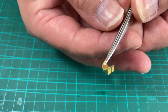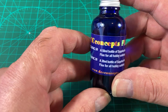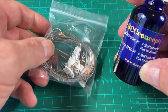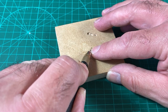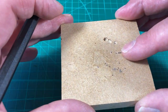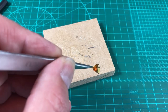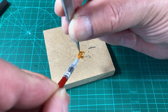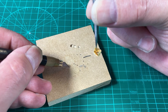With lots of tweaking and manipulating I've now got it into a position where I'm more or less happy, so I'm going to try soldering it. I'll use DCC Concepts liquid flux - Sapphire flux - and their 179 Sapphire flux-core solder as well. I'll just cut little parts of solder off - just little slivers - and apply it. I'll do one side at a time, applying the flux first.